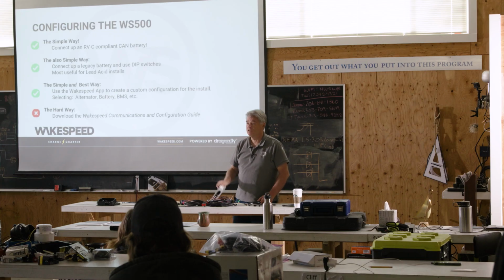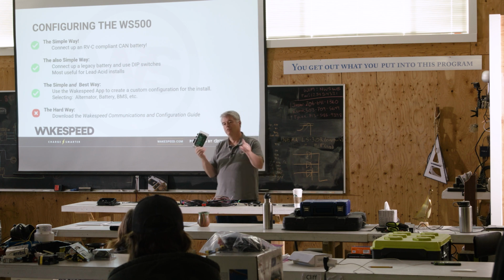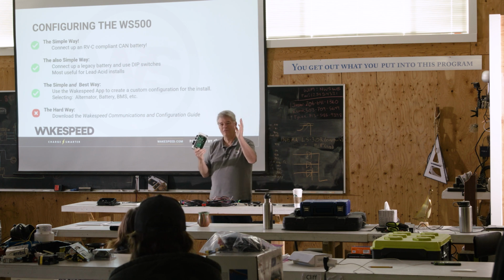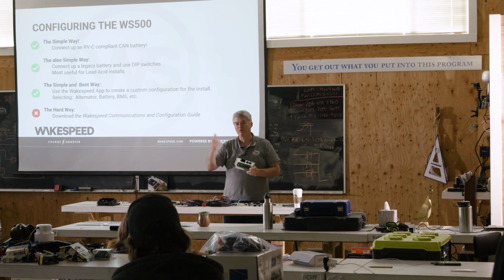And the reason for that is it takes an alternator about half a second to spool that energy down. The reason I wrote 2 seconds, and I'm the one who wrote 2 seconds in, is it lets me lose 1 or 2 of those CAN messages. They come out twice a second. See how that works? If he's sending, I'm going to do a disconnect, and that one gets swallowed or lost or corrupted, I can lose 2, get the 3rd one, have time to safely shut down. That's kind of the thinking that went into all this stuff.